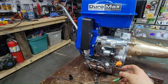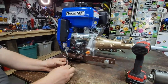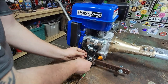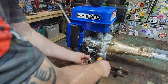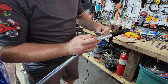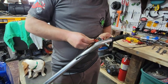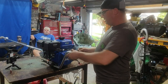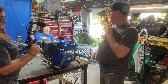We'll run these two cables up our handle to our kill switch and zip tie all this together. On the wiring diagram, you can see it right here — these two wires are the ones. It doesn't really matter which is which, because if you ground it by hitting that button, it kills the engine. And that's it — we have a kill switch. You clip it to your shirt or run it through your shirt. You fall off, and it shuts the engine down so you don't get chopped up by your prop.